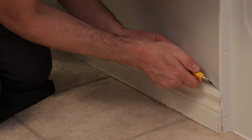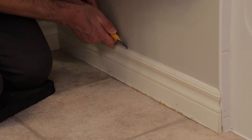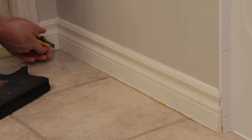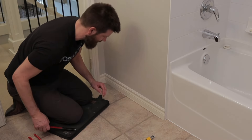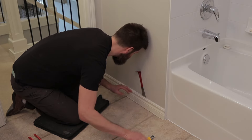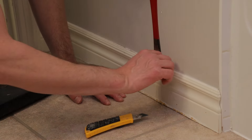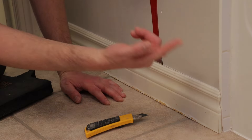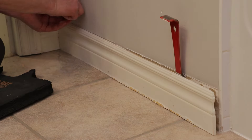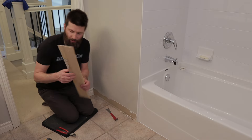So take your time. First step: get your knife out and just cut along the top edge nice and carefully. Cut in the corner too — a lot of times they put caulking in the corner to hide any gaps. Then get a pry bar, slide it in, and keep an eye out for sections that need a bit more cutting. If you're not careful and you don't cut it all the way, it pulls and tears out the paper section. We've got the baseboard all taken off nice — we have not damaged the wall.